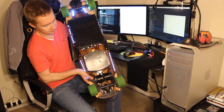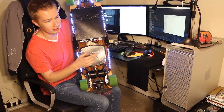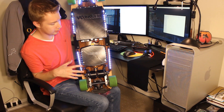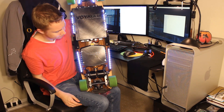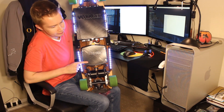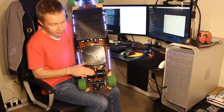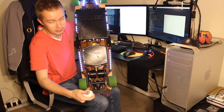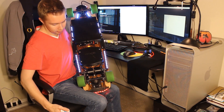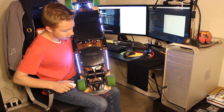Down in the bottom box is the motor drive. Inside there are two VESCs designed by Benjamin Vedder, as well as bypass capacitors, a 5-volt regulator for the LED lighting system — I used an external regulator for thermal reasons given how many LEDs there are — and the nunchuck receiver. This board is controlled with a Nintendo Wii nunchuck. In the future there'll be Bluetooth for streaming log data to a Raspberry Pi in my backpack. Down here are some relatively large motors — super fast and super loud. You can see the brake light glows red, and you can actually trigger it like a brake signal without engaging the motors.